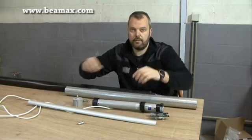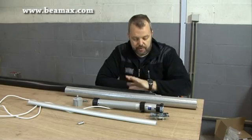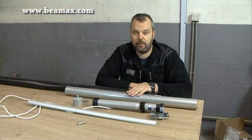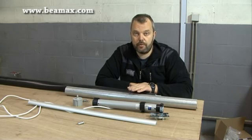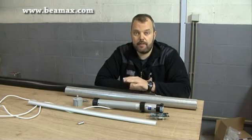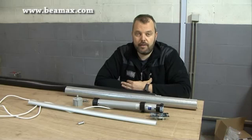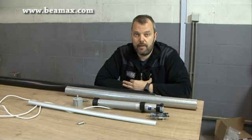That's basically all you need to create your own electric projection screen. It would be best to do this when you have something to hide the screen with, because the tube and the fixations will be visible. If it's just on a plain wall it might stand out too much, so if you have a false ceiling where you can create a wooden box around it, it will look a lot nicer. The biggest difficulty is not putting it all together — it's getting the screen perfectly flat, as you don't want distortion in the screen fabric, so that may require some work and testing.